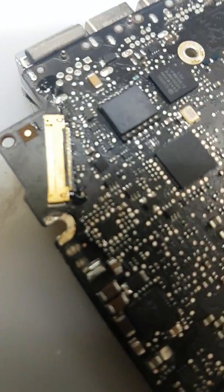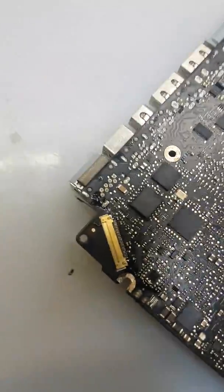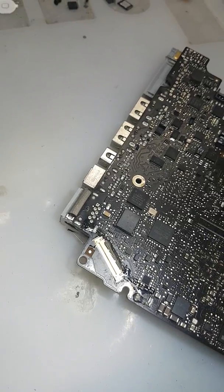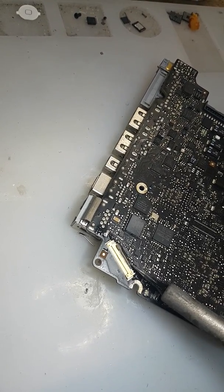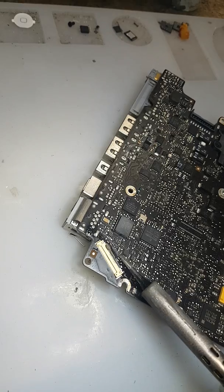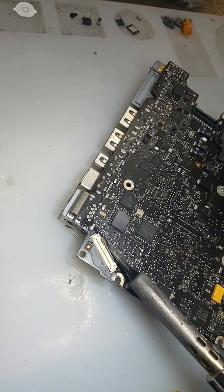I've only done the two anchor points so far. Now I'm going to slowly solder the rest. Put some flux on it. The easy method is to go from the side and simply start brushing across. The key to it is good flux. This is a basic soldering iron so no need to worry too much - just simply brush it across.